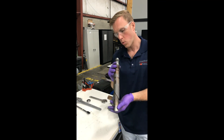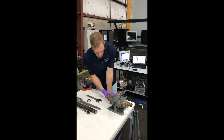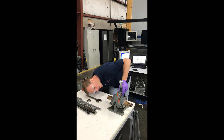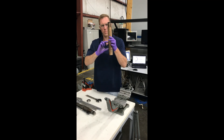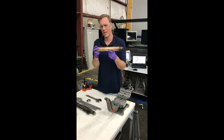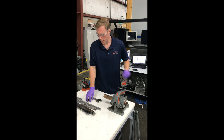Really you can service it quite well by cleaning out the ID of the signal shaft, replacing o-rings, and cleaning any mud between the helix and the signal shaft. This is the large spring — you'd want to check that for any sort of damage. Another word of caution: that ceramic sleeve only goes about that far up, so you really can grip it above the ceramic sleeve to prevent any damage. That sleeve sits on a shoulder in there and is epoxied in by our production team. You'd want to inspect the ID and inspect the ceramic sleeve inside, then put it back together with all new o-rings and a new wear band if necessary.